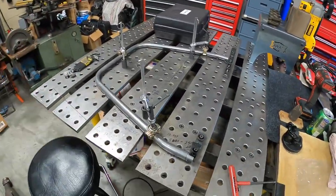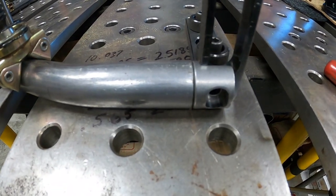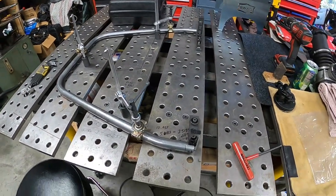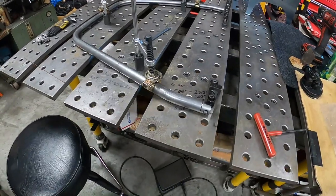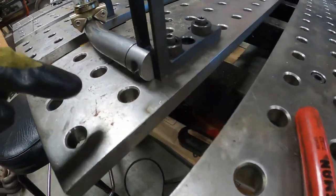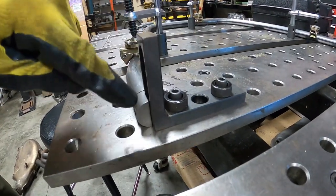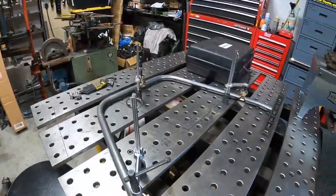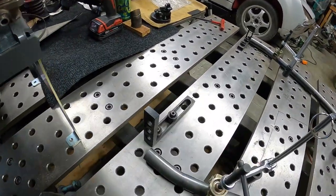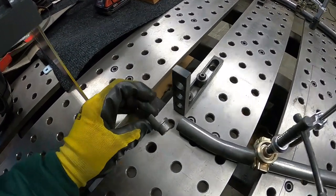So what we're doing here today is we're going to go ahead and get the removable bungs tacked onto that fourth transaxle mount undertube that we made. I just want to give you a quick overview of one application of the fixturing table. What I've done is located this little bung and locked down a 90 to keep this thing dead vertical. Then I've clamped the tube in place, but on this side it's just a random width — the width that ended up being the width of the engine cradle — so I want to be able to locate this one vertical too.